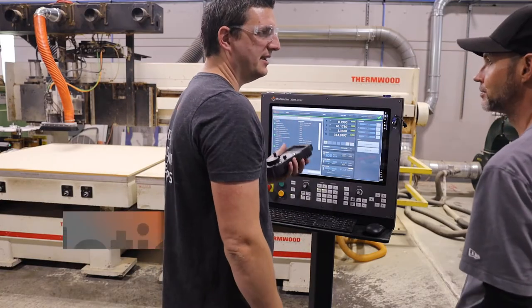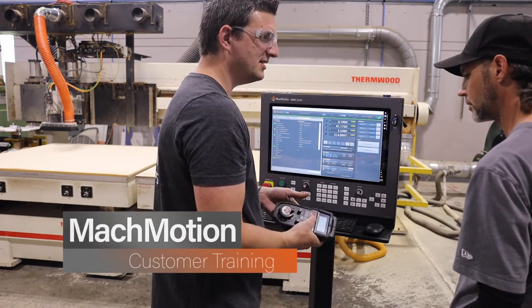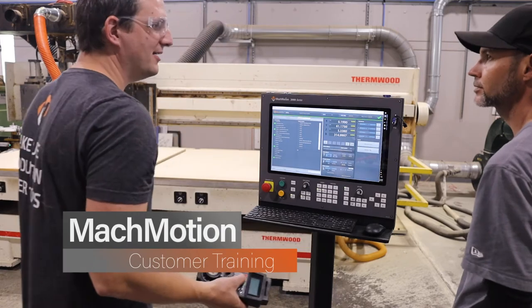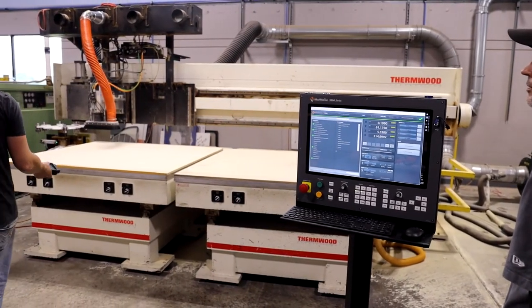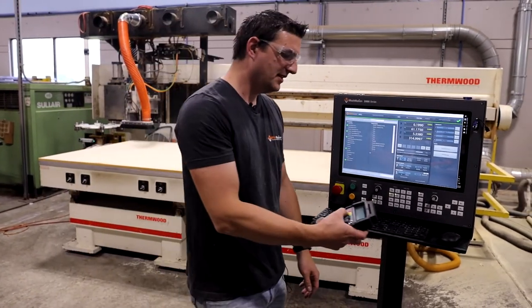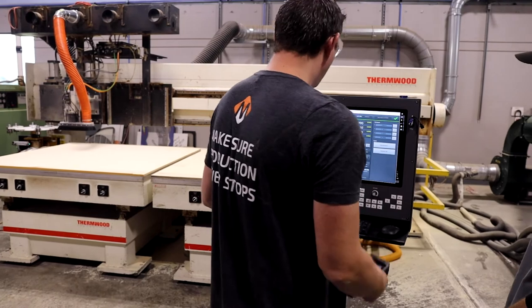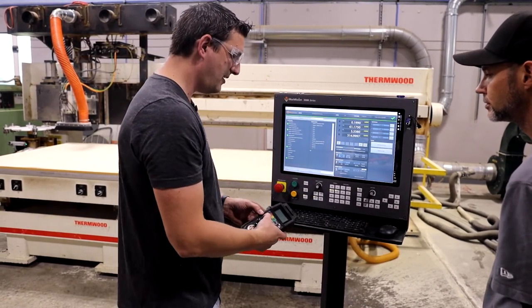But for touching off and stuff, it's really nice. The other thing is you can hit your feed hold button. So sometimes if it's a new part and I'm worried about it, I only have enough material for one of them, you can be over here watching it closer and then hit feed hold if there's a problem. Yeah. Cabinet had one. Okay. Well, you've got a feed hold here. So you've got all the same control here.